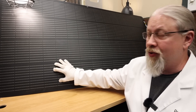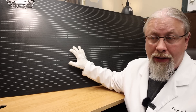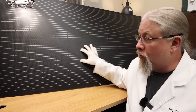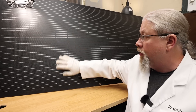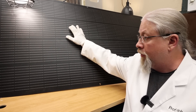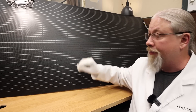One of the nice things about this panel is it's only 2.1 millimeters thin, as you can see during the folding test. It weighs only 7 pounds, so it's very lightweight and very thin. Inside this panel is a fiberglass core — everybody knows how strong fiberglass is. It does have an ETFE coating, which is what makes it shiny. You can see the light reflecting off of it. That makes it waterproof and very durable, so it's very difficult to scratch this panel.